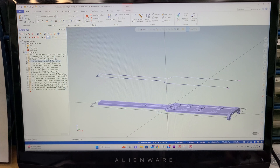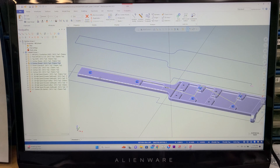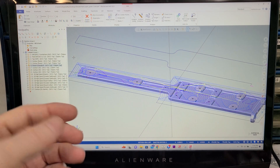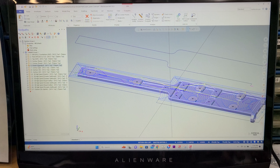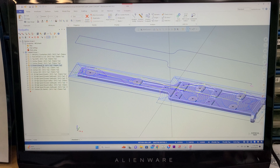So that takes care of the first four operations. And then after that, we go into contouring off some areas by these holes, and then after that I can put bolts in. Once we get those contours done and the bolts in, away we go with two layers of pocket just to surface off this thing, get it down to its height — quarter-inch high. I do two layers because it's too much material to leave a good surface finish, so I do a clean-up cut basically.